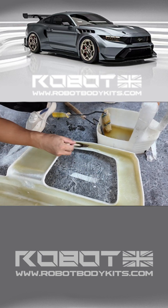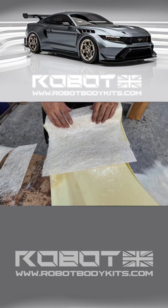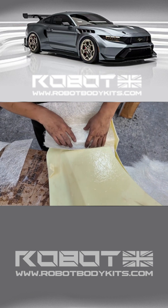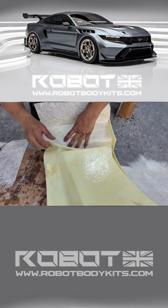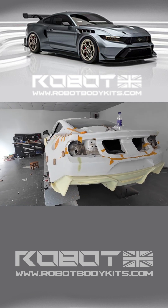Although these 3D-printed pieces are only used for mold making and might be discarded afterward, during the resin curing process the heat can deform the 3D-printed parts, especially under high temperatures or direct sunlight. That's why we reinforce the back with fiberglass.